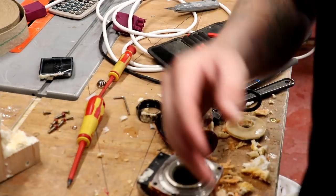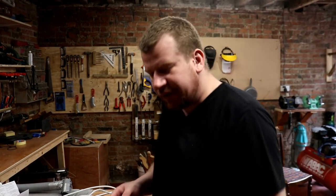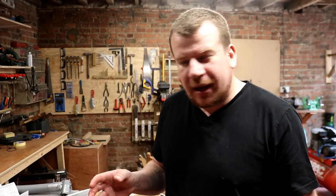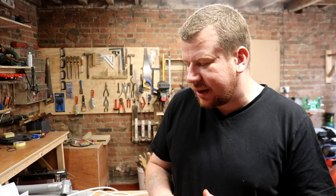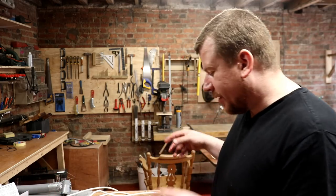Anyway, we can see what the problem has been. All we need to do is just exchange this for a new pump, and we should be good to go. Bit of a bummer, but at least we've figured out what the problem is. So, main thing I need to do is isolate the glycol supply so we don't lose any by accident overnight, and then get the fermenters turned back on so at least we can see what temperatures they're sat at. I think they'll be fine. They're all at the conditioning stage anyway. And then get one of these pumps here ASAP. I might even have to go and bite the bullet and buy an expensive one from Screwfix or something.